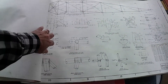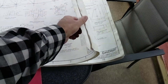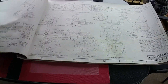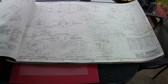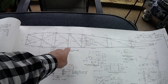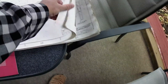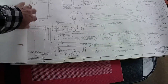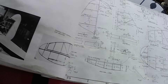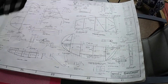It is not an easy airplane to build. When I built mine, I bought all the pieces piecemeal — I bought this kit, I bought that kit. But when you buy the fuselage kit for this airplane, you get a 20-foot sonotube full of 20-foot pieces of round pipe, and you're basically cutting and fitting every one of those joints. You can call it a fuselage kit if you want, but it's a plans-built airplane. You've got to follow these plans, and there are a few mistakes in the plans that you'll find out if you start to build it — a couple of errors, basically just in the spacing of the bulkheads when you go to put the two pieces of the airplane together.